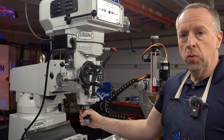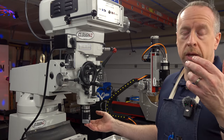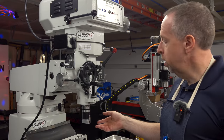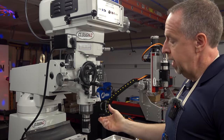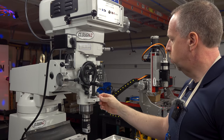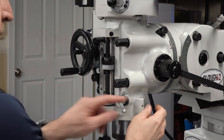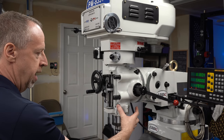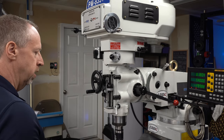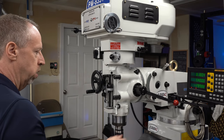Now that we've got a spinning tool, we need a way to move it vertically. This is commonly used while machining for things like drilling and boring, or it's used to set to a particular height to take a cut — and you do that with the quill locked. The quill is locked in position by this lever. It has a couple of pieces of brass that are milled out to fit against the curved sides of the quill, which runs in a precision bore — this just squeezes against it to lock it into position. When you are milling horizontally, you definitely want to have the quill locked.